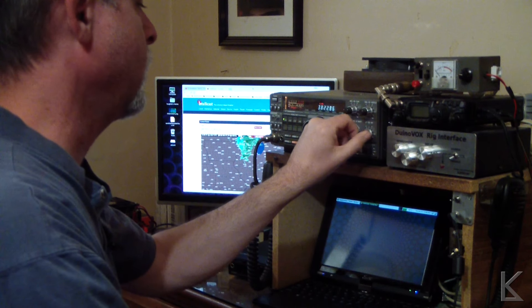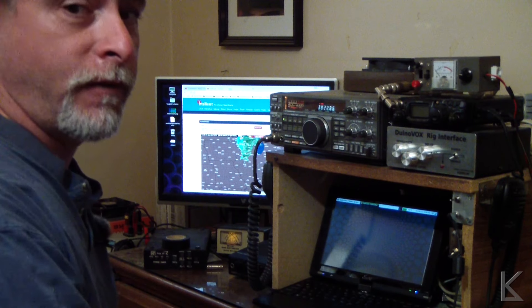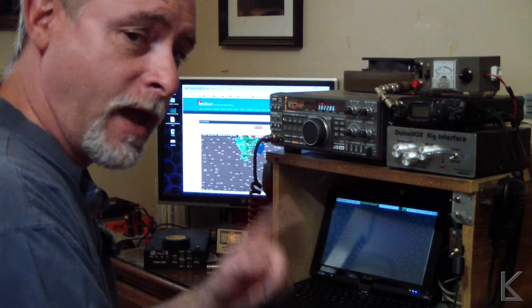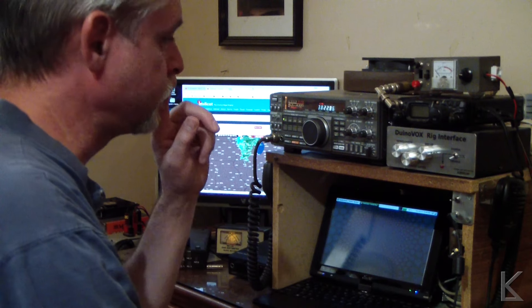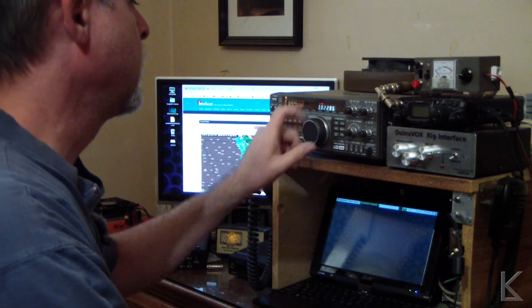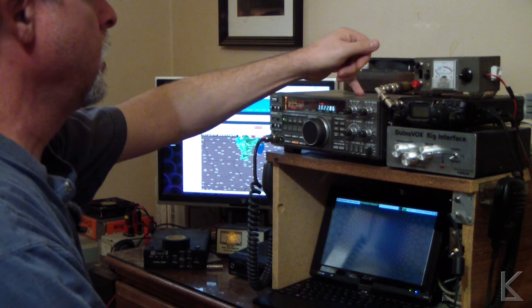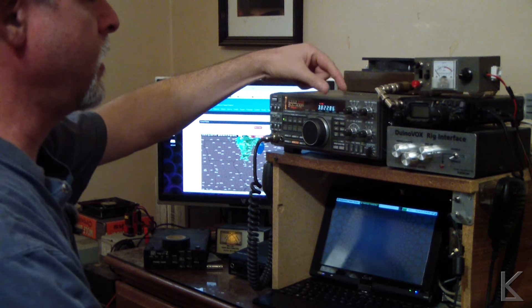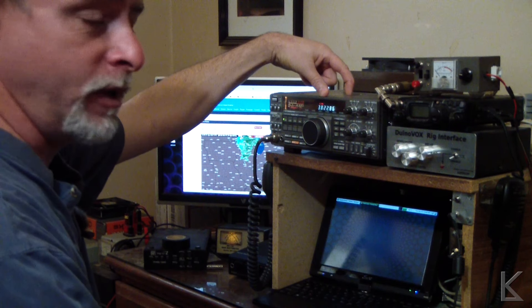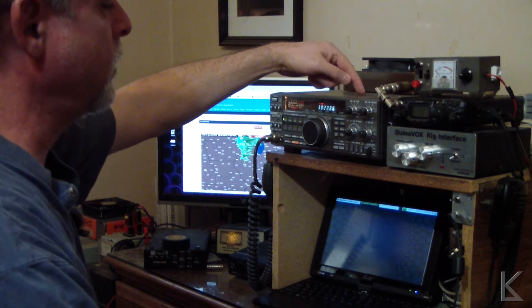Now it's gone — oh, there it is. I've got to figure that out. I have a suspicion: these fluorescent displays generate noise. The high voltage driver for those generates noise. The speaker is right here on the top front of the radio, in close proximity to that display — maybe only an inch and a half from it. So the speaker wire, if it gets close to that display, is known to pick up noise.